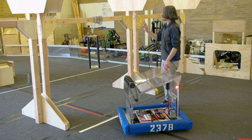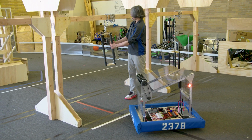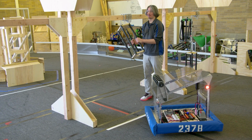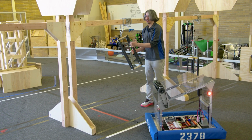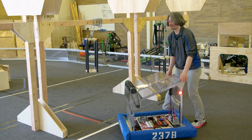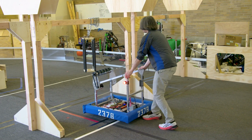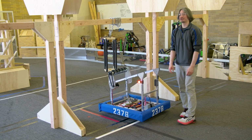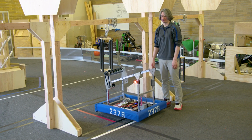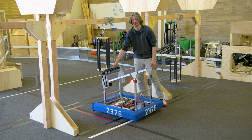But something to keep in mind is these things, and this one has some wood, and the chain adds some weight, but this is like beefy. This is 20 pounds or so, and this is steel. So we know how fast our robot goes. If we take our robot and we go full speed, we are about to smash basically a wrecking ball into the roller on our robot. That's bad. This is probably the most fragile piece of the robot to hit.